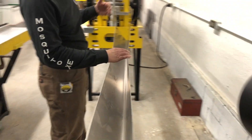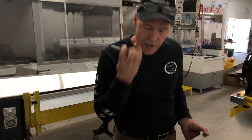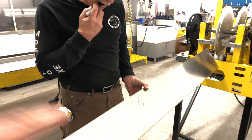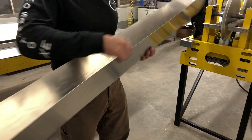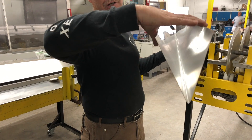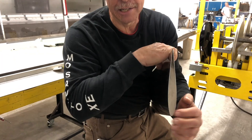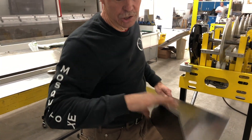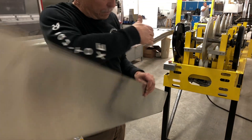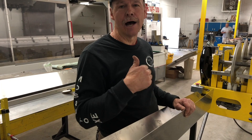Before we move from the machine, as we feed it we'll take a marker and mark A side or B side so we know the difference. It's an asymmetrical airfoil — this is the top. When you look at it, you'd never be able to tell the difference with the naked eye, but there is a difference. That difference becomes apparent when you stick it in the mold: there's going to be much more radius on the A side than on the B side. It's critical to mark it before it comes out of this machine because in the next step we have to know what side is down to actually bend the reflex.